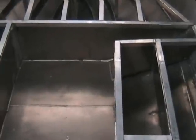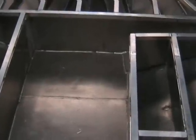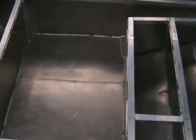The fuel tank void is a bit bigger than the actual tank for obvious reasons. It will fit a 300 litre tank in it approximately, and once the tank's in, that'll be supported with some RHS cross bracing so we can build the floor down over the top, and we'll pour a little bit of foam in each of the corners just to support it and pack it tight. You usually get a 20 year life out of an aluminium tank, a 5mm tank, but you probably get longer since it's contained inside its own void.